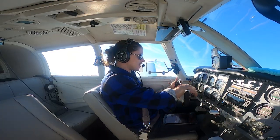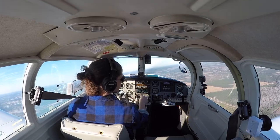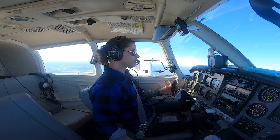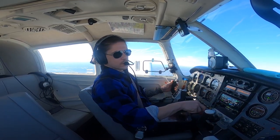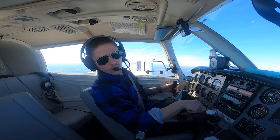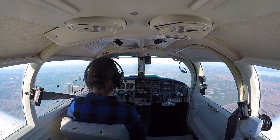Fuel pumps coming off, landing light coming off. Leaning to 13 and a half — this thing runs so much better, I can't get over it. Three thousand feet. I'm bringing the power way back — going to go about 15 to 17 inches manifold pressure.